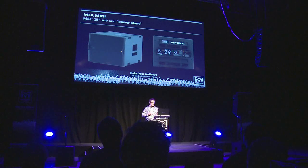The main supply is power factor corrected, meaning you can plug it in at 100 volts in Japan or 240 volts here, and it will range between those voltages. It also smooths out the current draw over the whole AC waveform, so you typically draw less current with a power factor corrected system than with a conventionally aspirated power amplifier. For simplicity of deployment, four-box systems can be set up using a preset button on the back of the MSX, or for bigger systems, a laptop can be connected via USB or the UNet proprietary network to control and monitor the system.